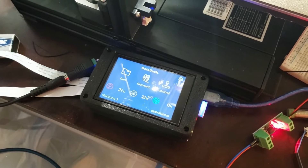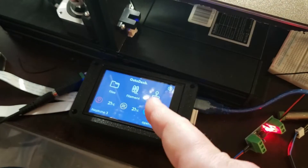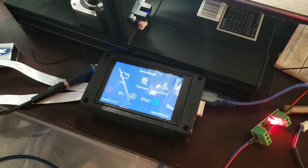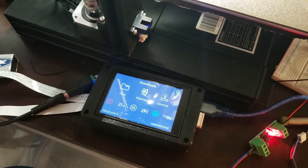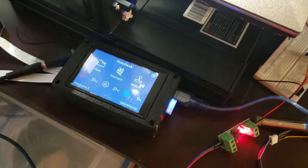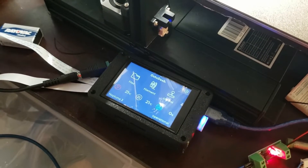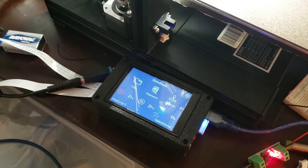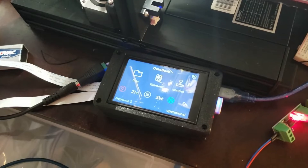If you follow my video for loading the software onto the Libre Renegade, this is not much different. The only difference is that you have to install the MKS Pi Armbian version available on their GitHub. You install that, and then step-by-step it's pretty much the same: go into the Klipper script, run the Octoprint install, take out Klipper screen but leave everything else in, do the auto-login, disable the password, and this thing just comes up. It comes up and it works.